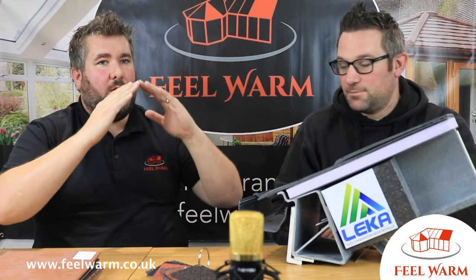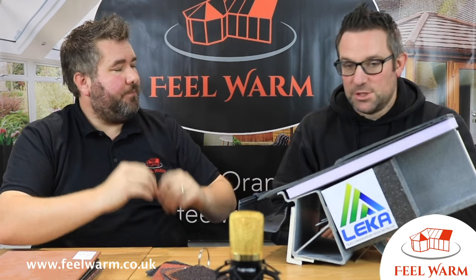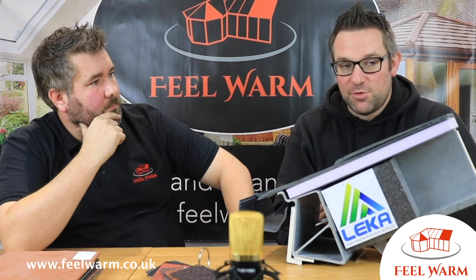Yeah. And because they're vaulted ceilings, they're going to need bracing up one way or another. Absolutely. The people who normally do this don't have the technical capability to understand that. As far as they're concerned, they're chippies and they're just slinging some timber up. They think they're doing it right, but I'm sorry, I've been in this industry for 20 years, and it's just not right.